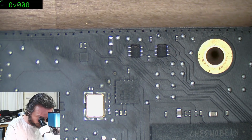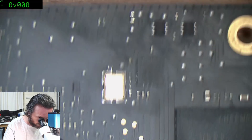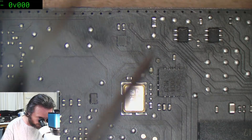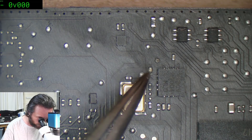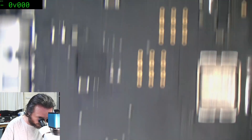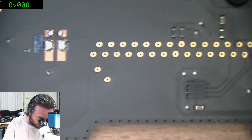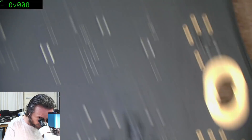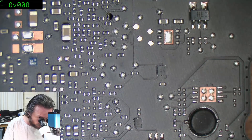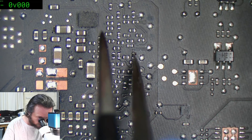Yeah, there's definitely a wash haze. And I believe that's the clock area. Yeah, that's just weird — that cap's actually gone. Let's find out what board this is and then we'll come back to that. I'm fairly sure that's the primary clock — the 25 MHz, 32 KHz RTC clock. So this board has been handled at some point. Board number 3476. A little bit of junk there.